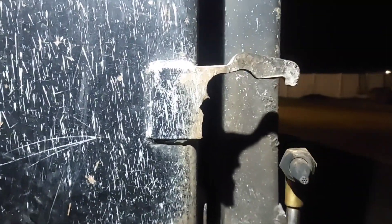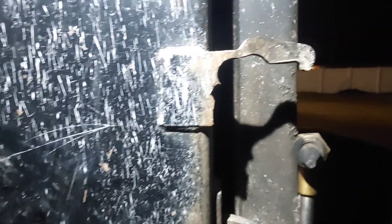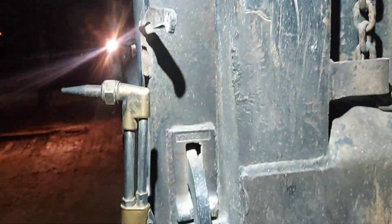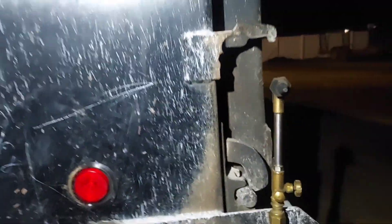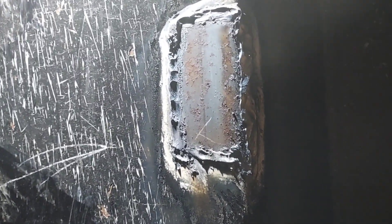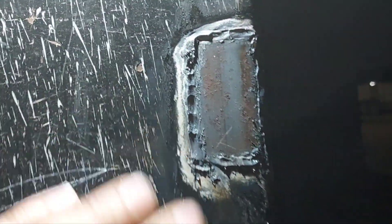I know I promised y'all another piece of equipment in the video, but the one I was expecting them to bring in — I've got to wait on parts for it, so I can't start on it yet. But here's this one. That's where the tailgate chains hook on an Oxbody dump bed. There's what it's supposed to look like. I already made the new piece — I just got to cut this one off and put the new one on. Now that I've got that cut off, I used the torch and the wash tip because it's like 10:30 at night and I didn't want to wake any of these nice people up around here. Now I just got to get my portable milling machine out and machine this down to a nice, flat, even surface — just make sure it's perfect before I stick this safety chain holder back on.